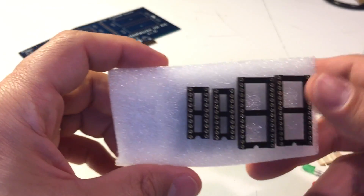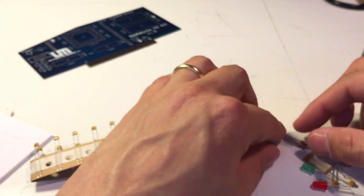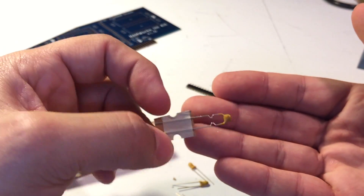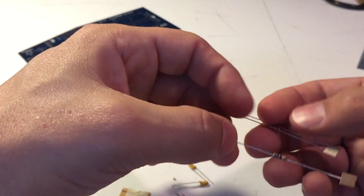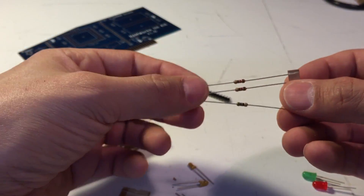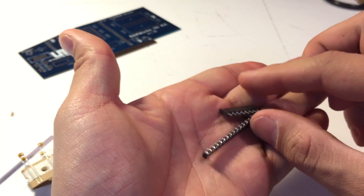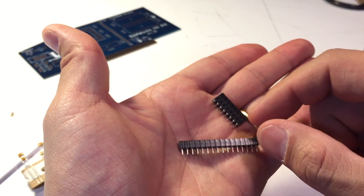There are sockets for going in the board. In the components bag we've got 14 capacitors, three smaller capacitors, a fuse — a fusible resettable type, so if you do something wrong it should trip and prevent you from frying things — resistors for various functions, LEDs for both power and activity indicators, and connector headers. The headers go on the back of the card to allow you to connect RGB boards and other things in classic Ramworks 3 fashion.